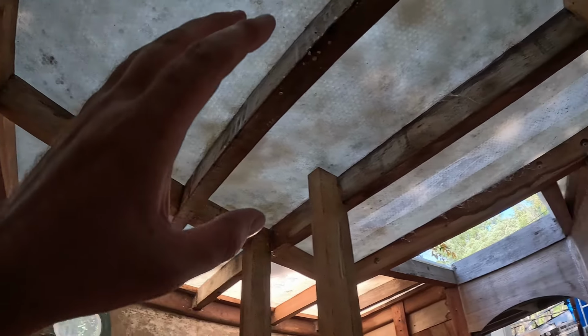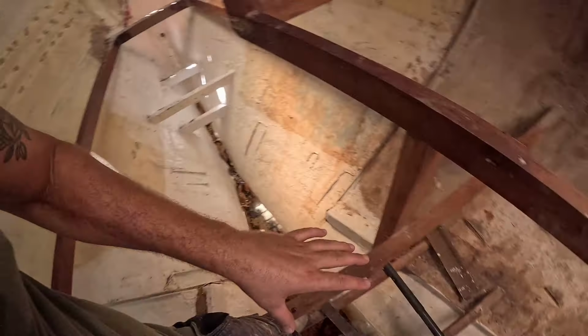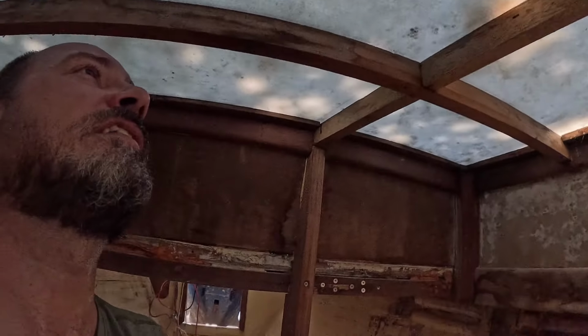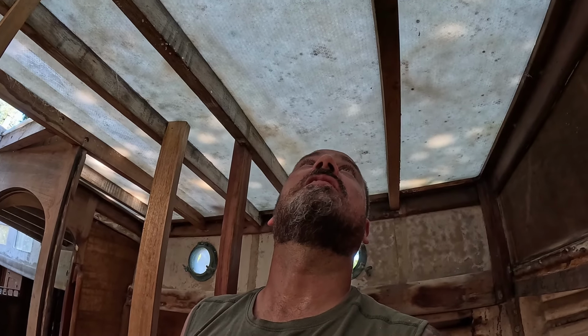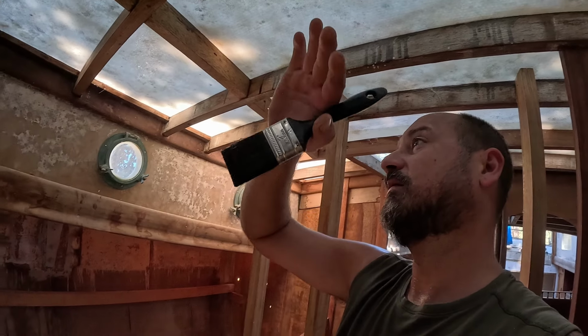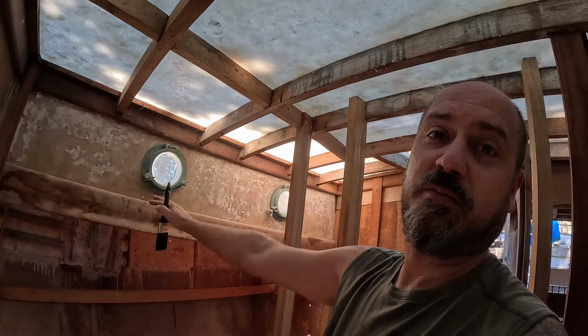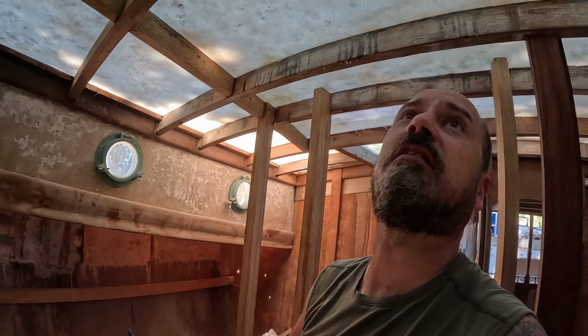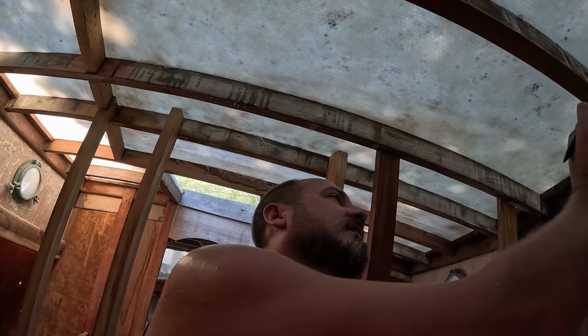See, this is going to be much nicer now on this side of this wall, which is the master bedroom. So the master bedroom area now is fully sealed with fiberglass underneath. And then we're going to do 2-3 layers on top to really thicken it up, make it nice and strong so you can jump on it. And that new layer over the top is also going to wrap down the sides and over the top of the new decking area. So it's one big sealed thing from the edge of the boat up over the kick rail, the tow rail. Beautiful. Good.